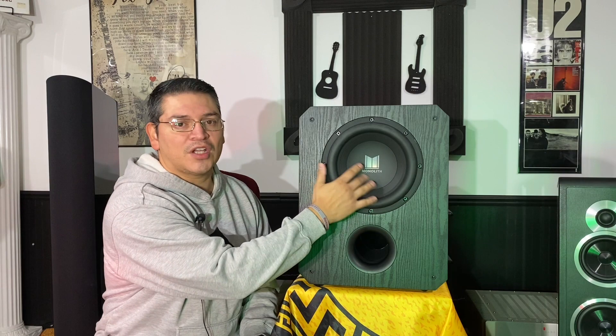Mid-bass gives you a smoothness to your sound and takes away a lot of the boominess of a powered subwoofer. The difference basically comes down to how the driver is built — the voice coil, the spider, the cone material whether carbon fiber, woven paper, or other materials — all that determines whether you get mid-bass. This sub doesn't have great mid-bass, and I can tell because I have it hooked up in my two-channel system where the powered subwoofer in my Tritons has noticeably smoother bass.